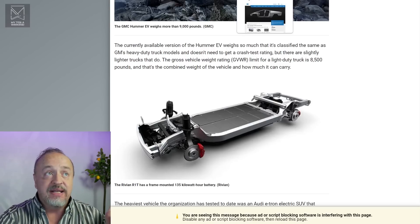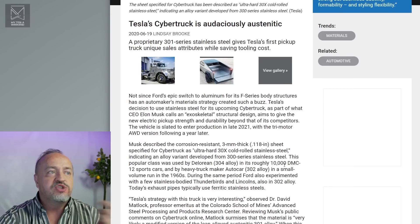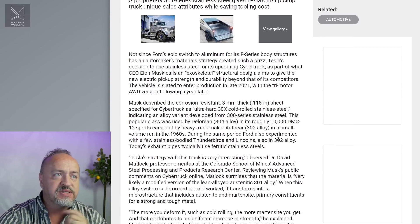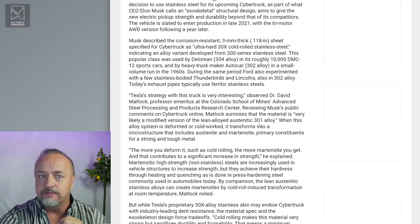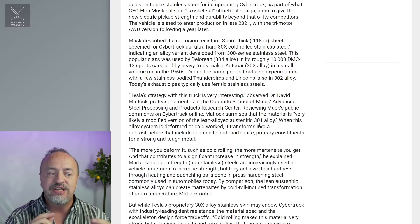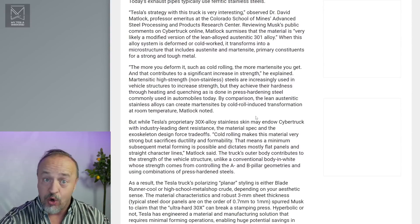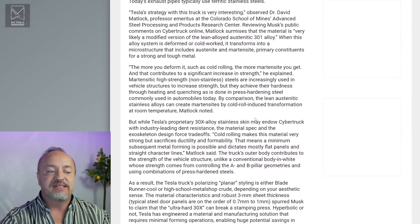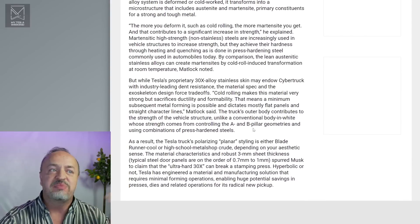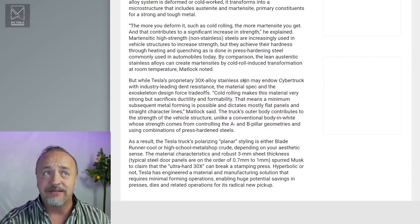They need to figure something out. I went ahead and did the math for you so you wouldn't have to. Interestingly, this article by SAE goes into what the stainless steel is likely to be and how it actually works — the ultra-hard, cold rolling makes it harder, not stronger. Just harder. It changes how ductile it is. Cold rolling cannot impart more tensile strength than the material actually has, but it does decrease the amount of give before it snaps. This article is actually quite complimentary to it. Some are not — we'll get to those too.